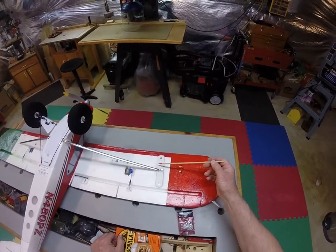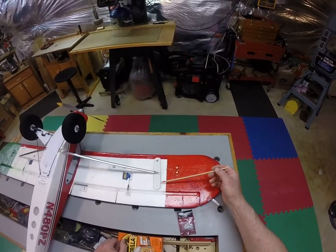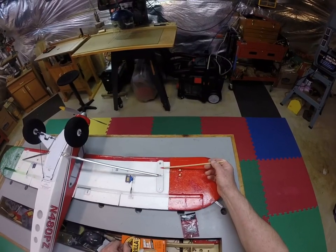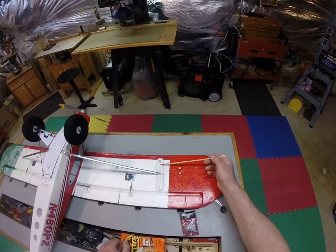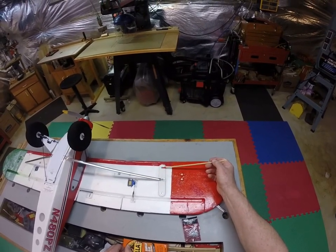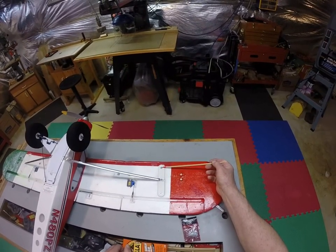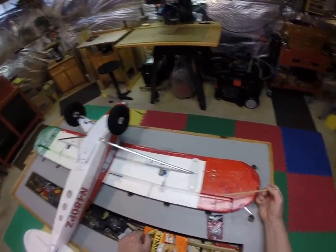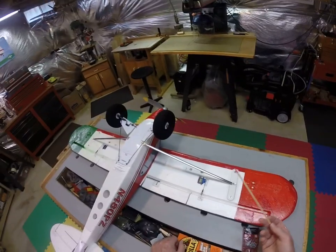I also used some good filler. I shaved these down — as you can see I put a one-inch radius on both ends. I used the same old mounting holes, so put the glue underneath and screw this wooden brace right down into the same old holes that were left by those white reinforcements in the wing. So it's both glued and screwed — it should stay as good as you can get.